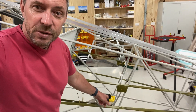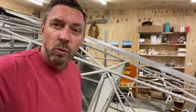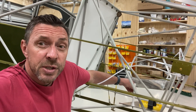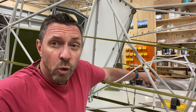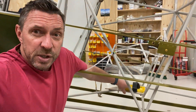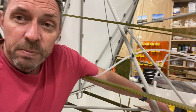First thing I did was reinstall a different tray for the ELT — the one I built initially just wasn't strong enough. That's worked really well. I've got the antenna in there. A couple of people have questioned the location of the antenna inside the fuselage, but I've thrown that on the forum, talked to a few radio guys, and I think it should work quite well. The ELT tray itself is bolted right through the frame with two bolts going through lugs on the frame, so it should be very, very solid.